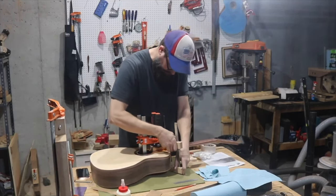Here's the bridge — Malaysian blackwood, matching the fretboard and headplate. I like to start with a square edge, which will be the top of the bridge. That little block plane and the number five low-angle jack plane are all I've used for all three guitar builds. The template is my Bridge 2.0 — the second bridge template I've made. I used the same shape as my second guitar build but tried to add a little more design to this one.